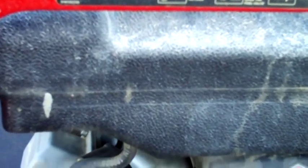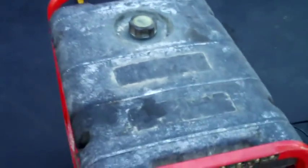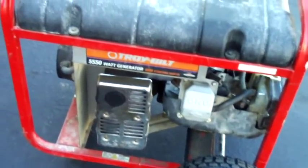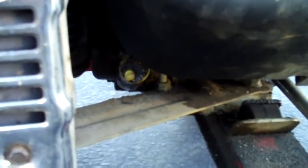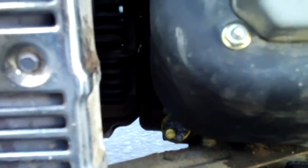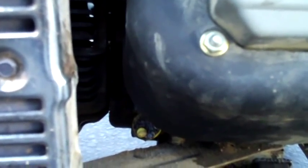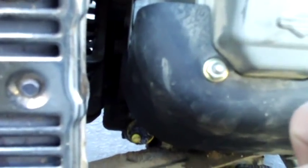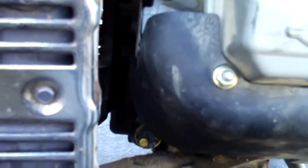I changed the gas in it, flushed out the tank — it had a little bit of trash — and put some fresh gas in it and some Sta-bil. The oil fill way down at the bottom there, that's what's leaking. The guy thought it was a rear seal. The alternator in there is turning and the fan is blowing all the oil around, which makes it look like a rear seal is going. But it's actually not that — the cap right here needed to be tightened correctly. They had it cross-threaded a little bit, so I pulled it back off, got the threads right, and screwed it all the way back down.